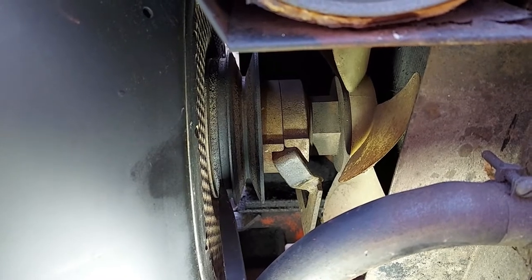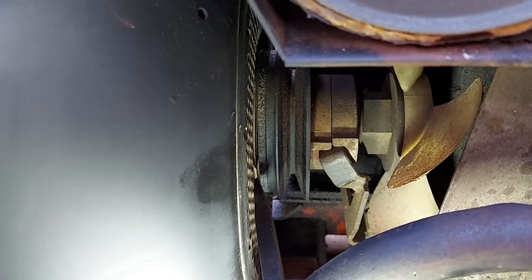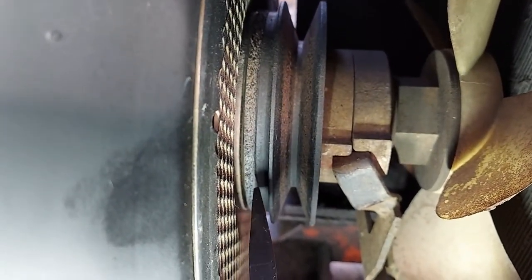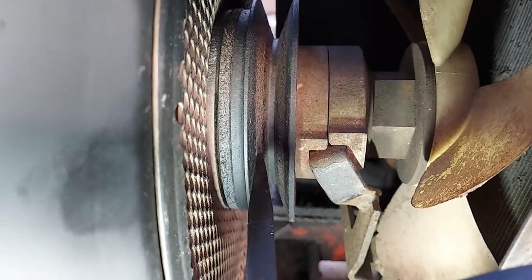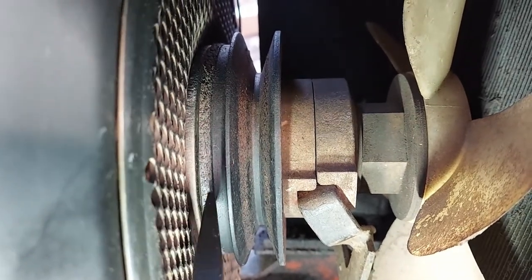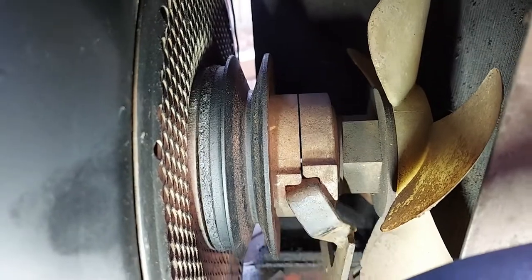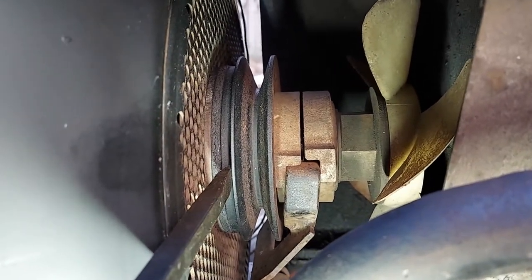Here's the gap behind this fiber disc — it's way too big. It's only supposed to be between four and seven thousandths, but basically as long as it's not touching when the clutch is off is what you're looking for. This is a huge gap, about an eighth of an inch. That could be a combination of worn shims, spring washers out of adjustment, bad bearings, or a worn clutch disc. When you adjust this, make sure you cycle your PTO handle a couple times so you can see how it operates — it comes in and grabs, and that's where your friction is.